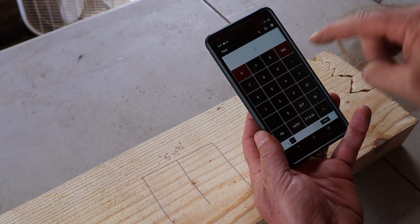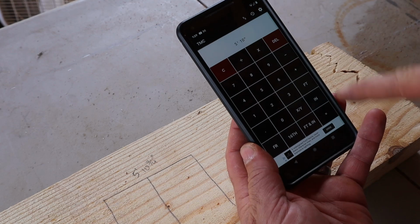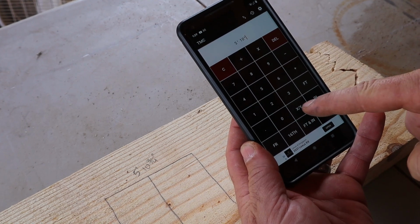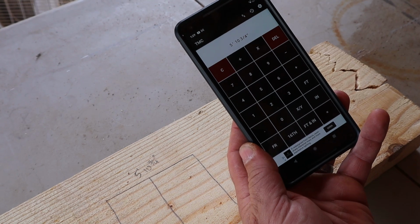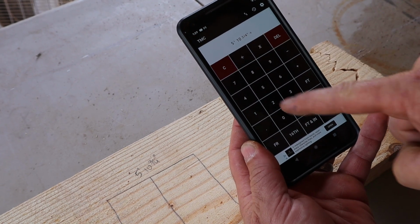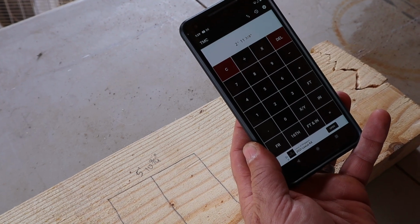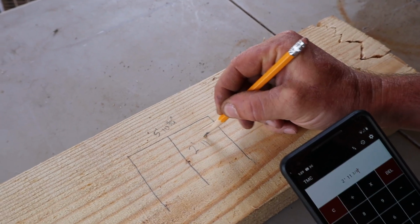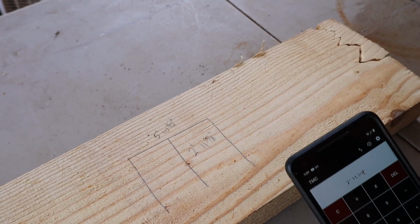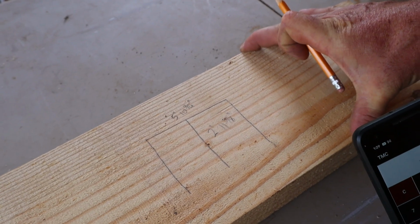But anyway, it's really neat because you could write 5'10" and then X over Y would be 3/4. So 5'10" 3/4 divided by 2, and it'll put it in fractions for you. So 2'11 3/8" is each section. Now, what I did, I went and measured the boards that we had laying around in the barn,